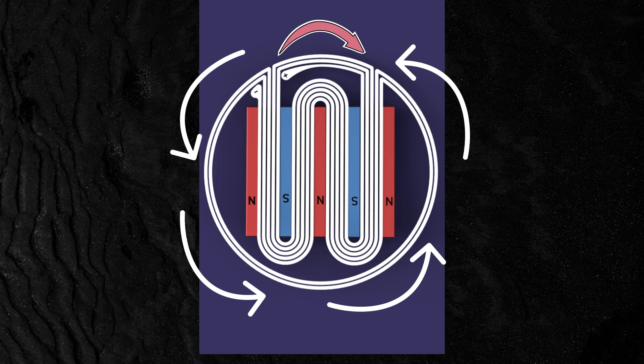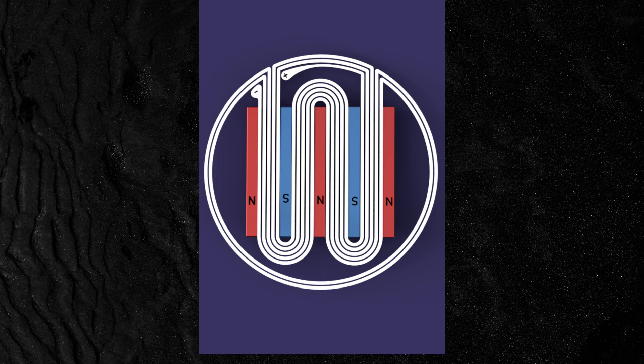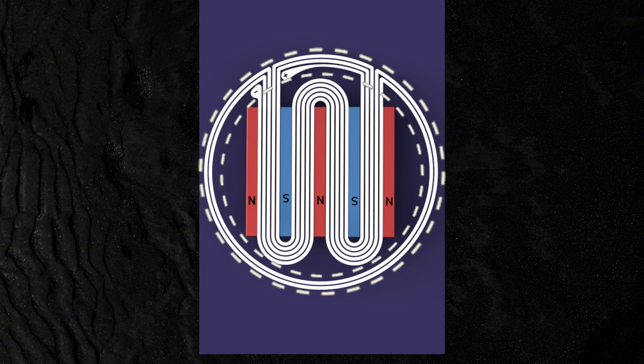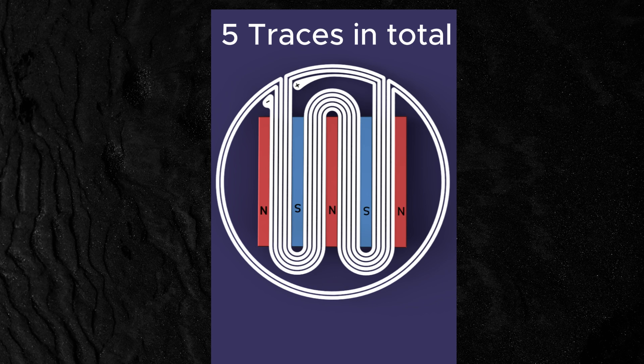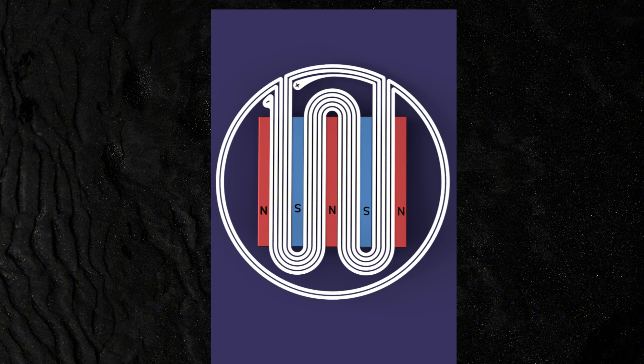If you're having trouble understanding this, just pause the video and zoom in and try to follow the trace. So how is it more space efficient to split up the traces this way? If you stretch the coil to the edges of your headphone, since there is now a lesser number of traces between the edge of the headphone and the contact points, the active membrane will be able to be much larger than on the previous design, where the connection points were three trace lengths away from the edge. Keep in mind we have five traces on this coil, so not only do we get one more trace and better impedance, but we also put the contact points further out, which lets us make the active part of the membrane bigger.